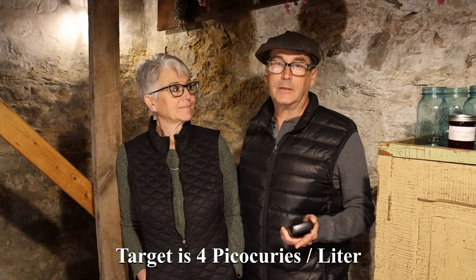The number two problem is a little more complicated and more serious — we have a radon issue. We hired a remediation contractor. They come in, saw holes in the floor, and put PVC pipe with fans to create negative pressure under the slab and draw out any radon coming up through the soil. That did provide some relief for our larder and the rest of the house — down to about 10 to 12 in our larder. But we need to find the source of the radon, and that is coming from our root cellar. The measure in our root cellar was over 200 picocuries per liter.